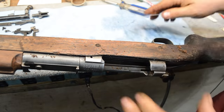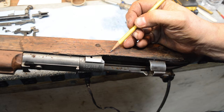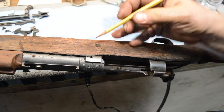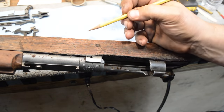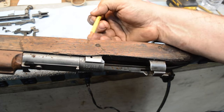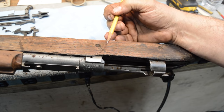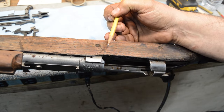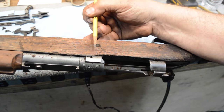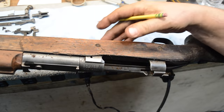One of the things I like about scrapers is, let's assume that this cut right here through the stock was a cartouche, that somebody knocked on the end of this and put that in. You'll notice we have not cut that away. We've skated right over the top of it. Scrapers are far more discriminant in not screwing up stampings than sandpaper is. And sandpaper, even back sandpaper, would ride down into this hole and back out again and muddy this whole thing up.